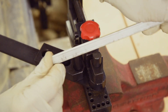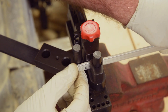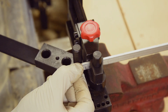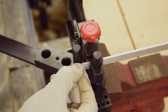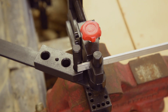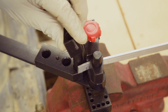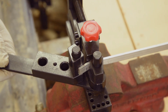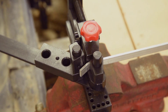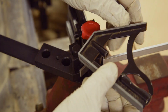First, I'm going to test some 1/8 inch thick aluminum, as that will be the closest thing to the copper I need it for — I'm not about to test on copper. One thing that was lacking from the product information was the smallest dimensions that could be bent. About the shortest leg this will handle with the included dies is about 3/4 of an inch, and the shortest 45 degree offset I could get was just a little over 5/8 of an inch. That's a little longer than I wanted, but it will do.